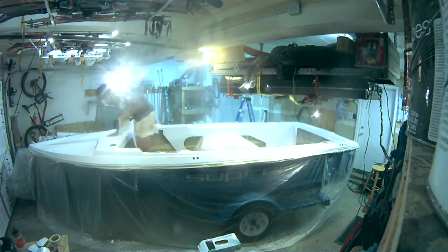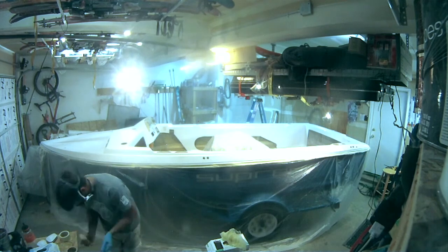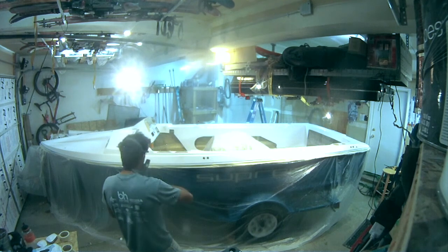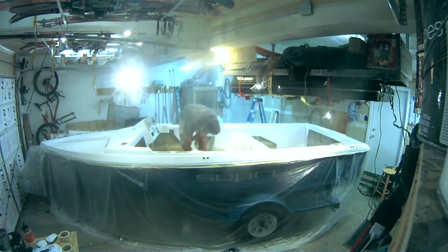Lastly, I went around the entire surface with a fresh tack cloth. My camera fell off the mount. Wrap the roller in masking tape to clear it of debris. I then poured in 5 ounces of the reducer and stirred well. At this point, the GoPro died. It had been running continuously since 9 a.m. that morning and either overheated or ran out of storage. In any case, I am showing a replay of the first coat and will leave you with some rambling thoughts